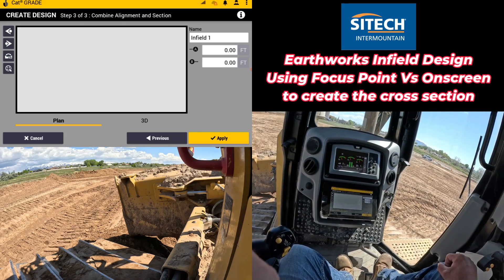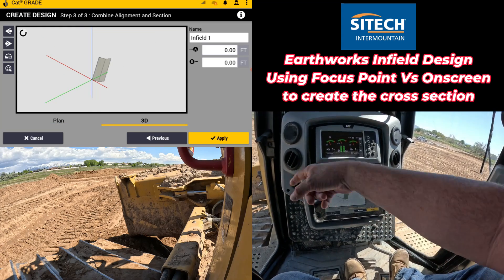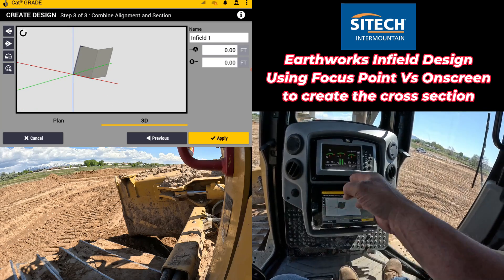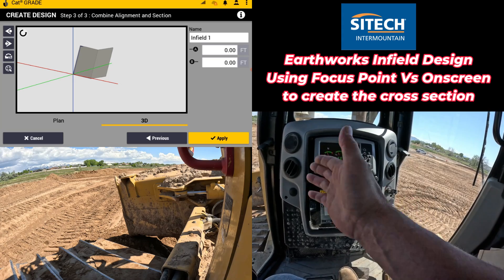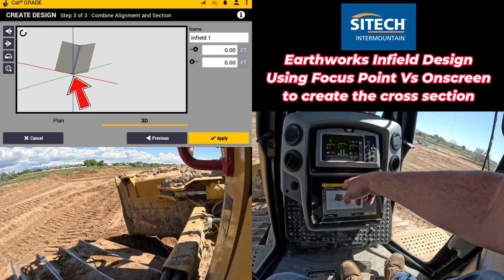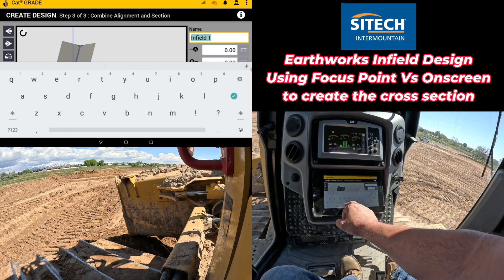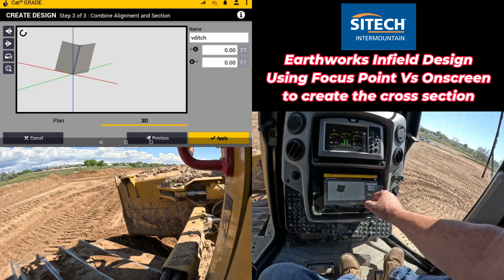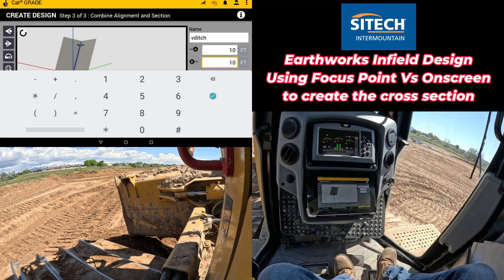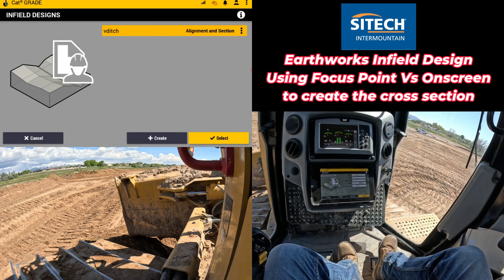If you needed to go out a little further to match something else you could, but I'm going to leave it just like that. We're going to hit the next button and go to the next screen. Right off the bat if you zoom in and put it on 3D, you'll notice that the alignment I shot down through the middle — if you've watched my other videos — is going to try to stay to the left side. So if I were to push okay right now and load it, my offset would be moved off to the right side. What I'm going to do is hit that button right there — the arrow — to put my alignment down the middle of the v-ditch. Then we'll go ahead and name it and extend it just a little further on each end. We'll give it 10 feet on the A side and 10 feet on the B side. We'll hit apply and now we've got an actual alignment set up there — we'll call it V-ditch.